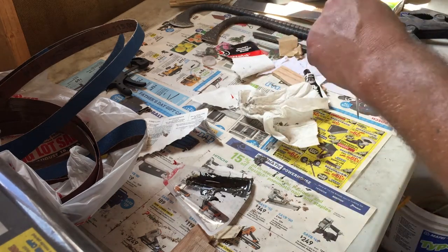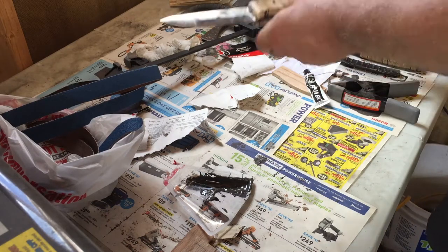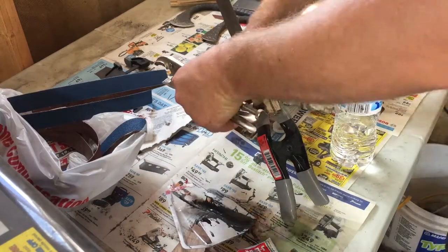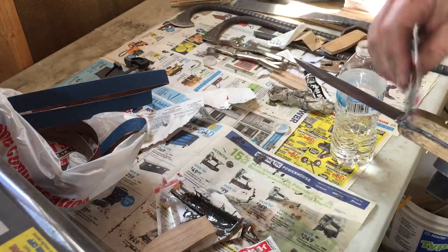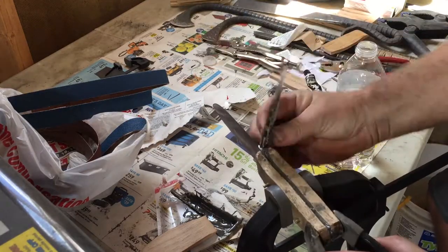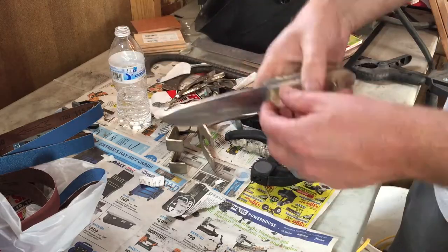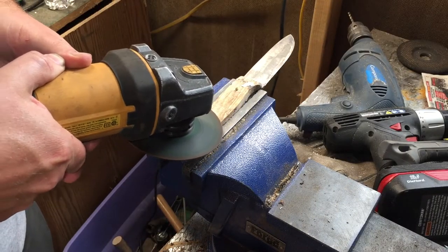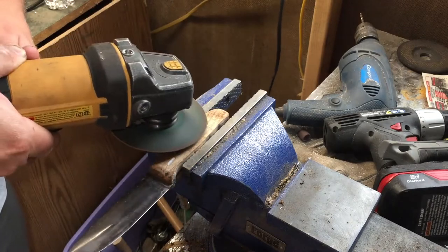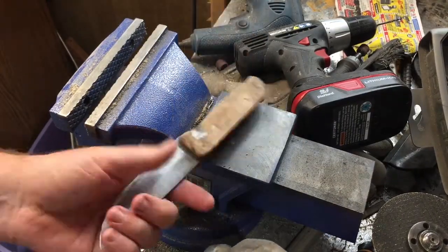I get it all clamped in place. It's kind of nice to clamp it at this stage because there's a lot of work left to do on the scales, and I really don't have to worry about damaging the surface — so I can crank down those clamps and apply some pressure. I even use some metal or welding clamps, really putting on as much pressure as I can without damaging the scale material. Those pins were short enough that I didn't really have to cut them off; I just ground them down a little bit with the cutting wheel, leaving them standing up maybe just an eighth of an inch. I used brass pins this time and they peen really nicely — it's much softer than steel, even mild steel.